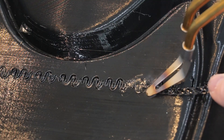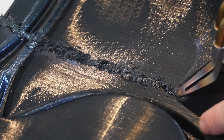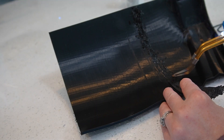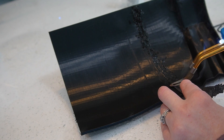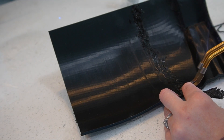Same as before, we're going to pull that trigger, except this time we're going to hold it a bit longer and melt the filament as needed. This one was a little different — I can't give you a clear timer; I just did it by feel. Just be mindful as you're working and shift your timing accordingly. This is also a great way to recycle the supports that I used to print this piece, which is typically one of my favorite reasons for choosing plastic welding as a means to connect pieces.